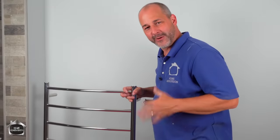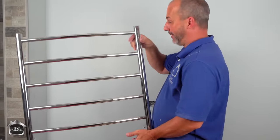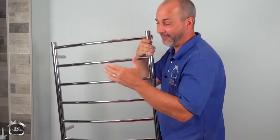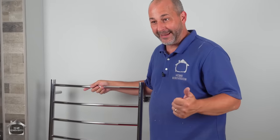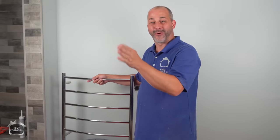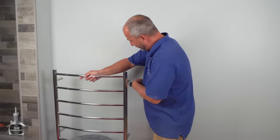So in this video, I'm going to show you how to install an awesome bathroom appliance called the electric heated towel rack. These bad boys look beautiful and function amazing. They warm your towels when you're coming out of the bathroom. Now, when it comes to installing one of these, there's really only a couple things you need to know. A, you got to get power to it. I prefer to run a line right from my light switch or my fan switch, depending which has more room, and bring it right over to this box.